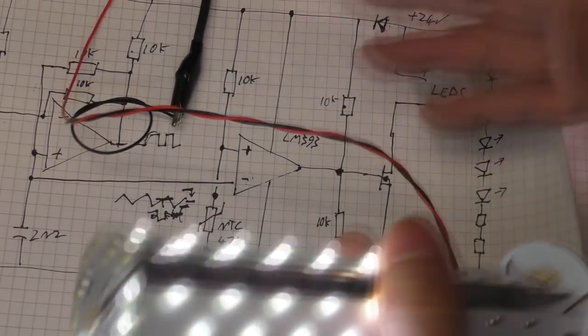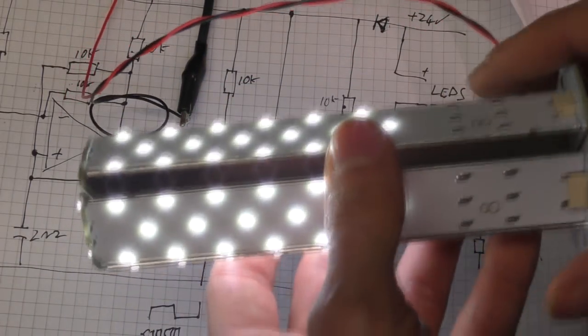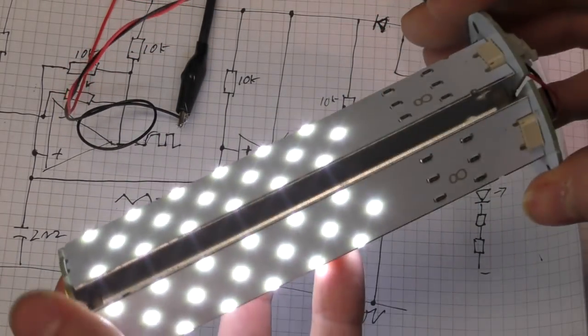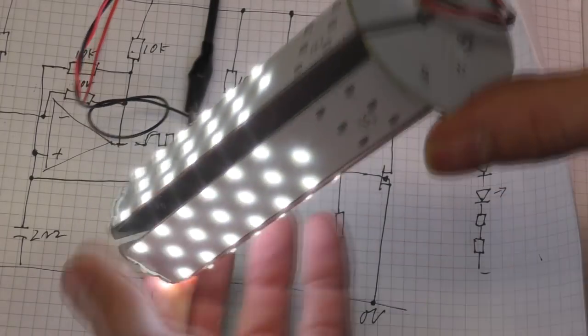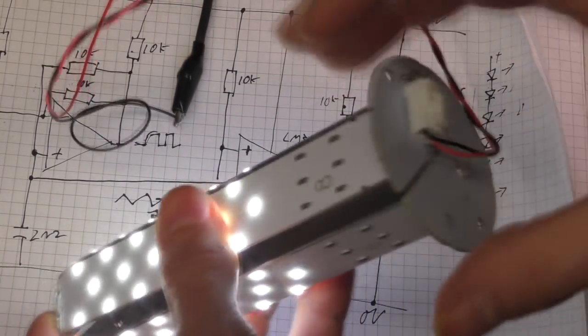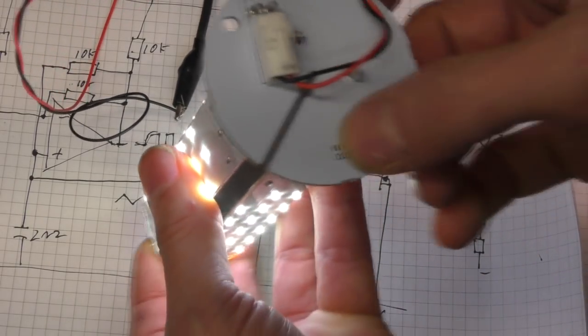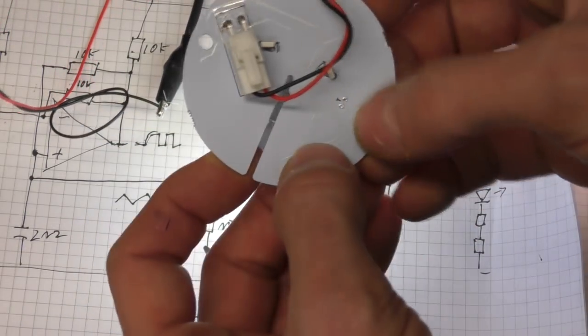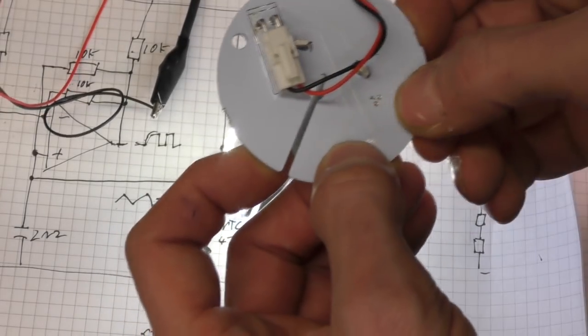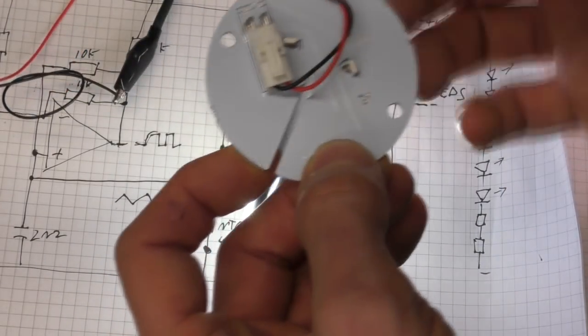Yeah, you've only got one chance to get these things right, so anything that might go wrong, it's always good to put a few little fallbacks and contingencies in there to deal with any issues. So if, for example, we did have an issue with this limiter tripping in too early, we could do a sort of emergency fix by shorting that, or potentially even putting a resistor across here to bias the thermistor slightly if it was maybe not cutting in early enough or something.